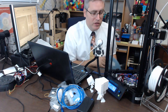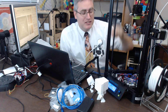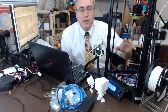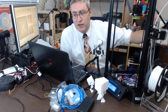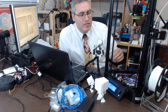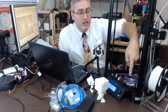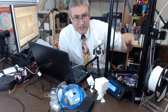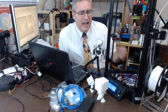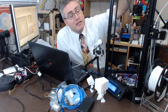After I put it all together and got the electronics sorted — which was fairly simple — I discovered you need to coordinate your end stops with the motors they come out of. When I was done, it was treating one side as the face when I had set up the face on the other side. No problem, I'll just rotate the motor cables. But because they're labeled X, Y, and Z — even though they're not really X, Y, Z — I didn't think about also rotating the end stop cables.